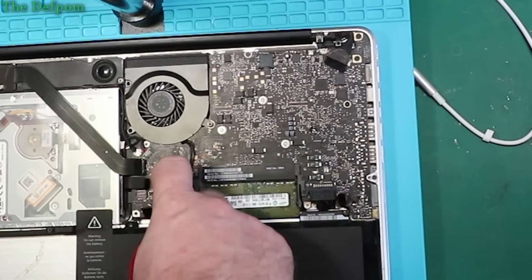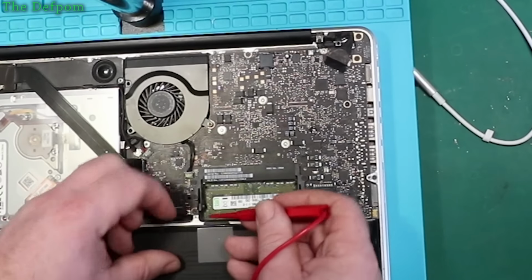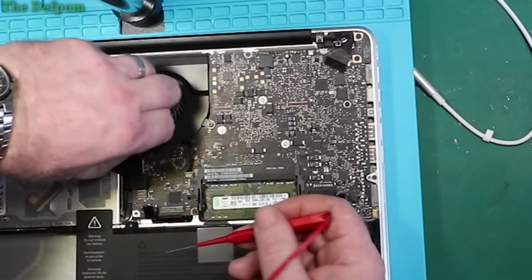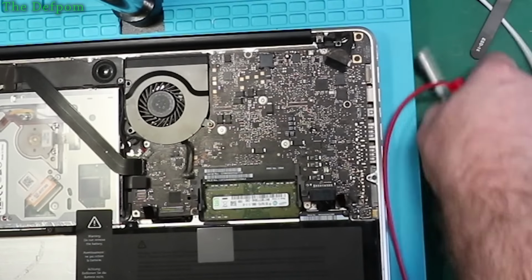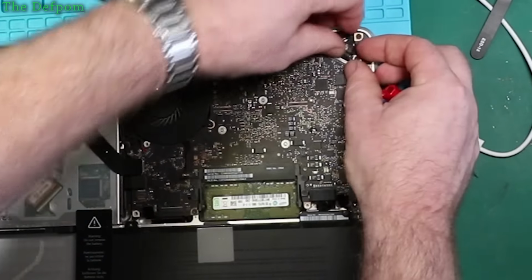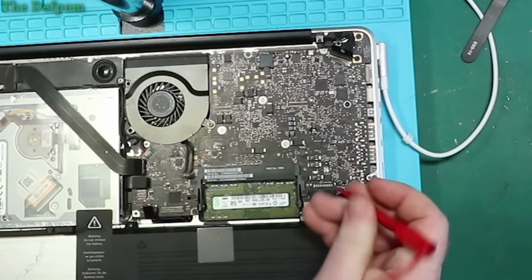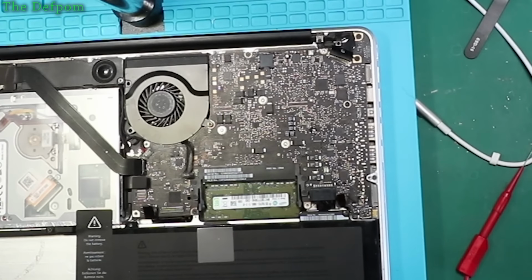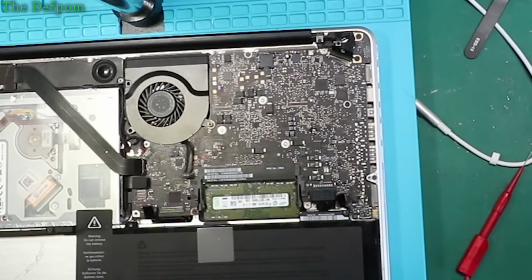Right. We've got some above the keyboard. And a backlight. And unplug this as well. No, it's still low, so okay, let's unplug the screen connector. Although it's unlikely to be this. This is not getting to that state, so it's not likely to be a problem. But we can do this by elimination, just to be sure. Nah, still no difference. As expected. Okay, so it's just dead. Which means it might be that chip there. But I'm going to look back and see what I can find.